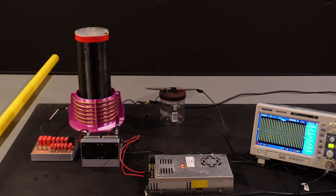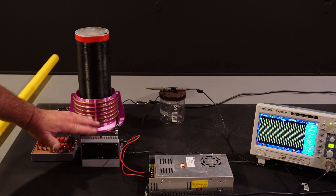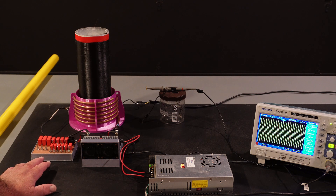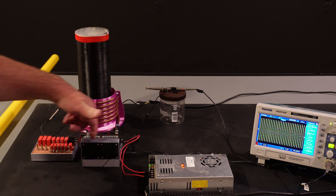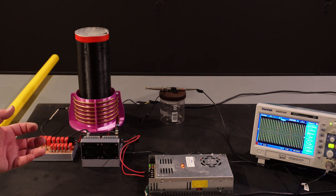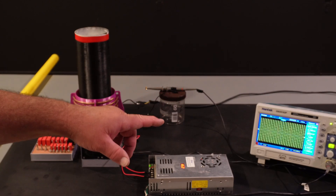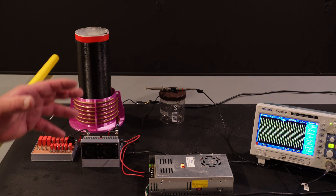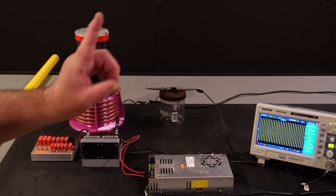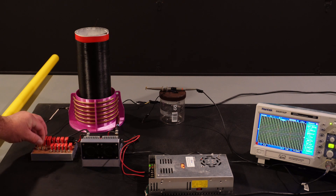As you can see, when I miss I'm able to fix it real quick. These right here are ice cold — these fans are doing their job, keeping our ZVS nice and cold. What happens when you're out of resonance is that the cap bank will put heat back into your circuit. That's why you need the two fans on your ZVS to keep it cool. You can see when the field builds out, the fans don't turn off. That has to do with being on one frequency — we're on a ZVS so it directs one frequency. This circuit likes to be close and run one frequency, meaning the fans will not be bothered by it.